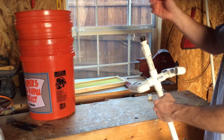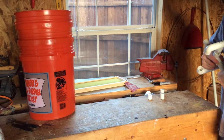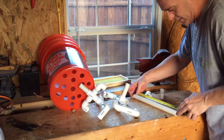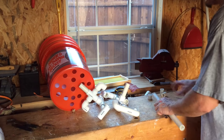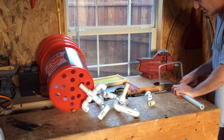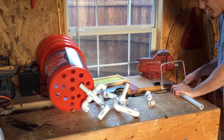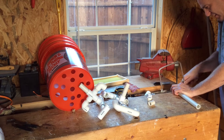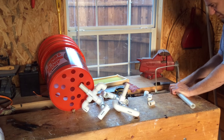I'll track that down in a minute, and it will all go on the end there. Let's see how long I had to shorten this — about 13 and a quarter. You could get by with 13 to be honest. It still sticks up a touch high for my taste, so I think I'll take another little quarter inch off and just make it an even 13. That seems to work good for my application. He does say in the instructions to dry fit this, test it, make sure it fits for you — so I would suggest you do the same thing. Once everything fits the right way, mark it off, take it back apart and glue it.